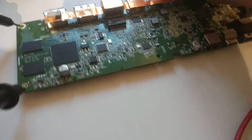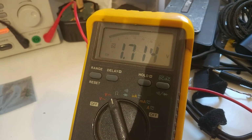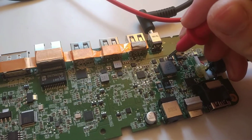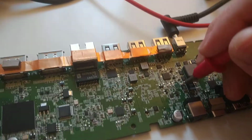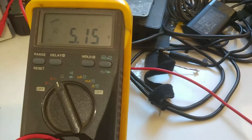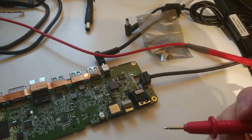But the thing is, if you unplug it and plug it back in, maybe you can short the middle pin with this, because it only has 1.7 volts at startup, and maybe the middle pin shorted with this would power on the dock all the time. I don't know. But the voltage goes up to 20 volts once the dock is validated. So only 5 volts, well, not goes to the laptop, but it's the laptop putting 5 volts into my USB-C travel dock, USB-C dock.